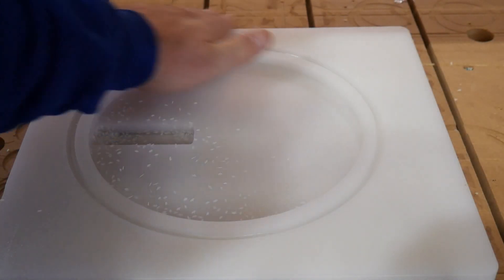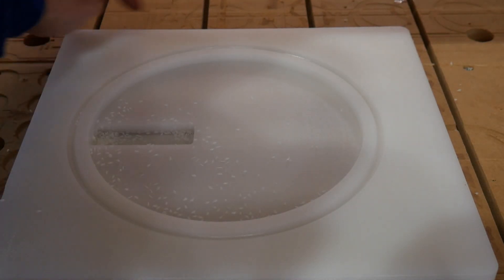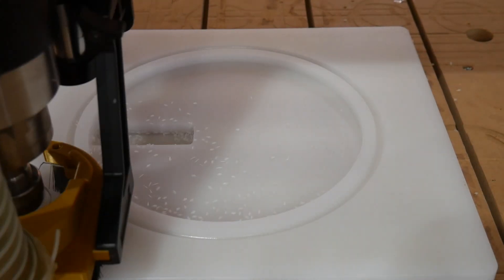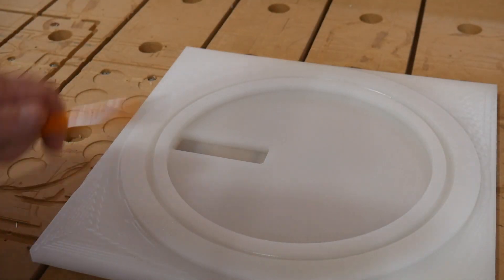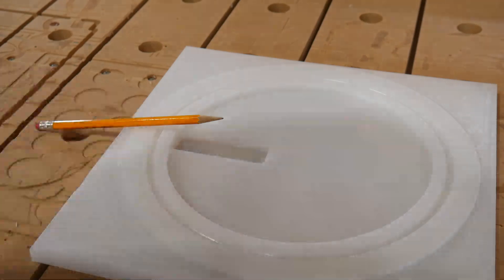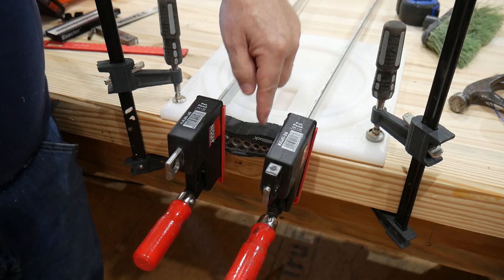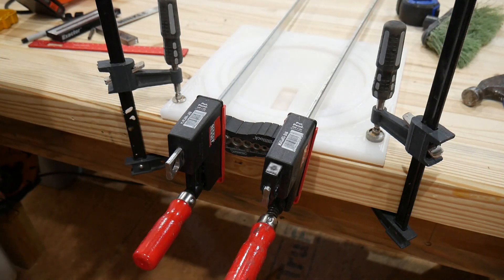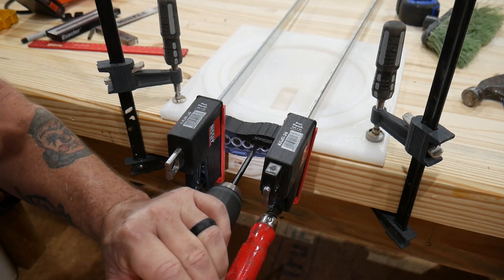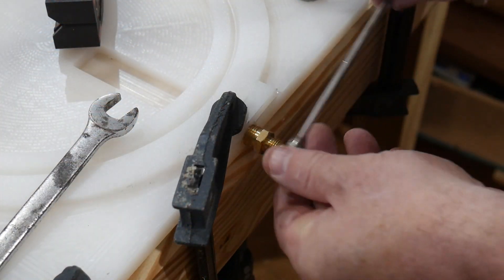Now what I'm going to do is lower these corners so I can drill holes in each corner and use hold-downs for these slots, or a screw hole where I can just screw it to the bed so it doesn't move. Next step — these have been lowered. Now we need to drill through here on an angle to create the air port and put the fitting in. There are no drill presses here, so we got a little creative — locking it to the bench using a Milescraft drill block, not sponsored, with a longer-than-normal drill bit to make sure we don't poke through the side. Once you get the hole the right size, the fitting will cut its own threads.